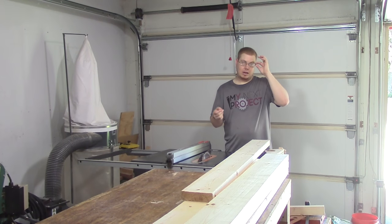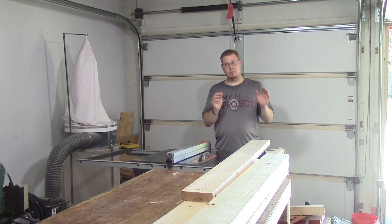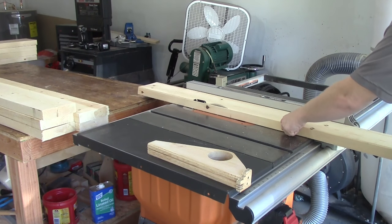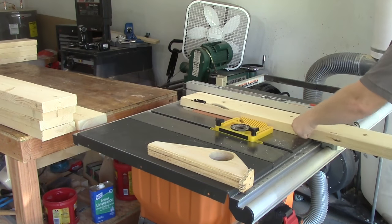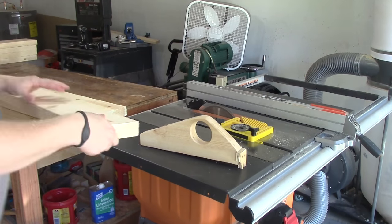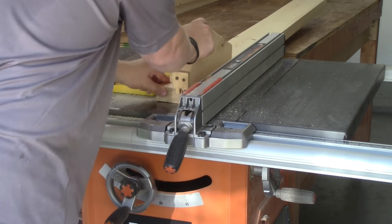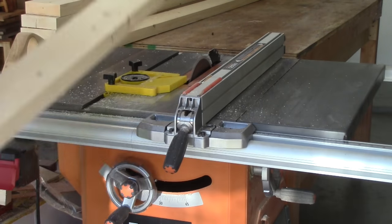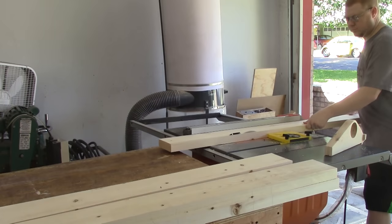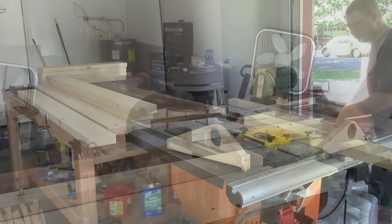You're not going to see me do all of it because I'm going to make about 24 cuts on these boards, cutting between an eighth and a quarter inch off each time to get down to my final dimensions, which is four and a half inches wide. Right now I'm making the first and second pass on the tabletop. It's really important to run each of these through four times to get it squared up. Now the final fourth pass — this is down to the final dimension, so these cutoffs are a little bit wider. After this we're ready to assemble the top together with glue and biscuits.